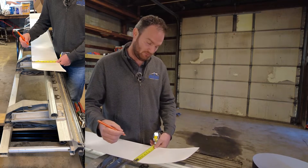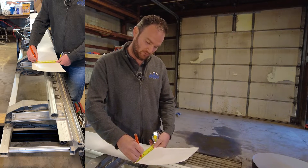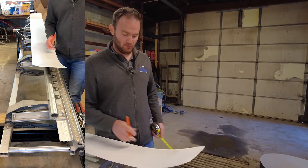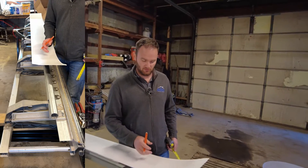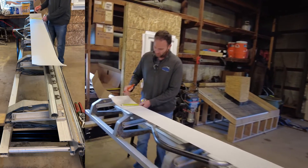We're going to make the fascia five and a half inches tall, so that puts me up to seven inches, then another half inch for a hem. I'm going to cut this off so we can see what the scoring looks like. I put the marks at both ends.